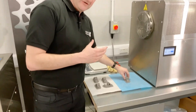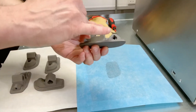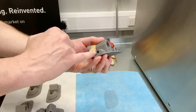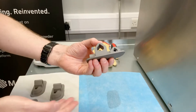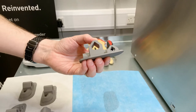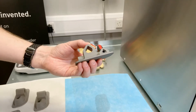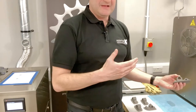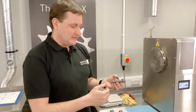This is of real benefit to companies using those materials and to the education sector wanting to print geometries that you can't machine. For example, looking at this part in the brown state — we've got diamond shapes and a channel running all the way through the bottom to come out the other end, along with teardrop shapes. That ensures the part is printed without any internal support structure, and it also means that part cannot be machined. It is true design for additive manufacturing, making it perfect for educational establishments investing in metal printing.